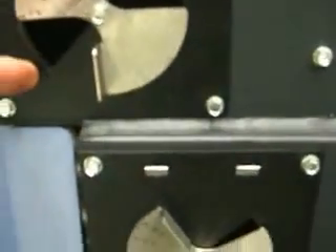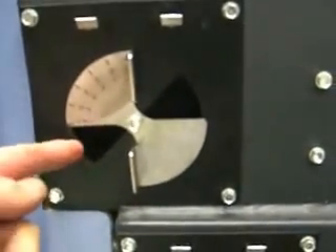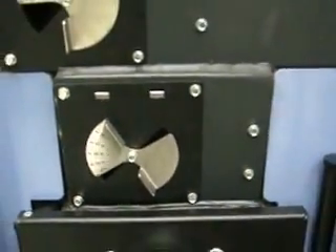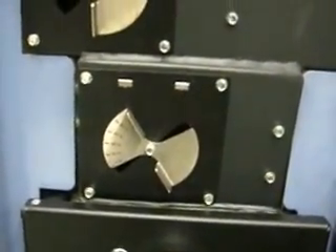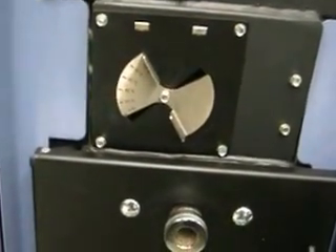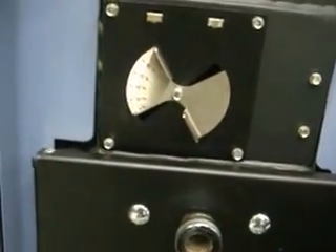What we've got at the top here is the primary or flame length control. And down the bottom below that we've got the secondary air control, which slightly adjusts the colour of the flame in the gasifying lower chamber. We've got our fire going there.